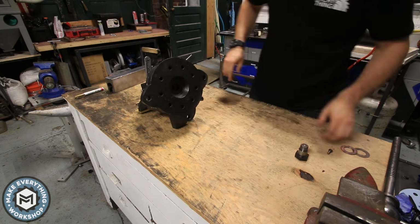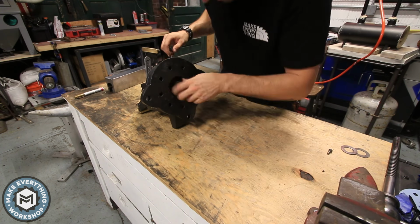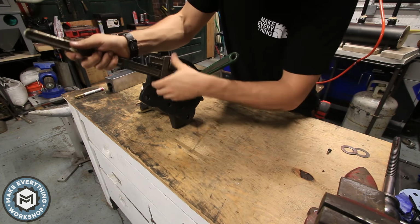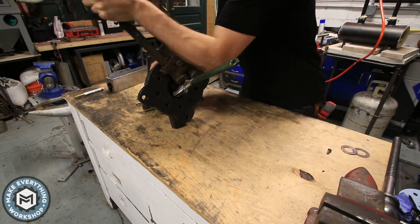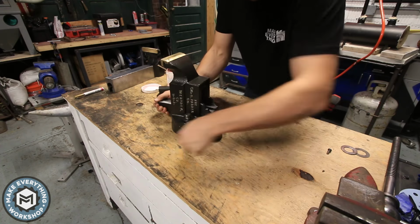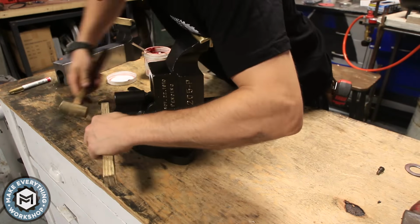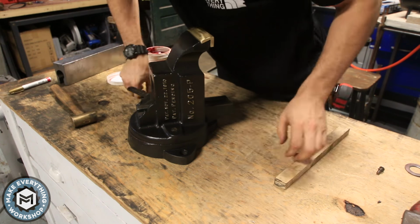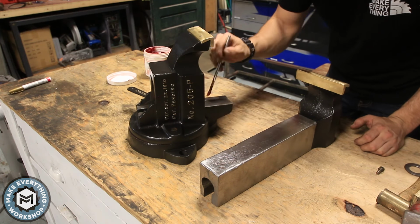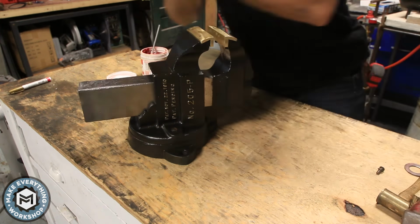And I decided to tighten down the swivel a little bit before adding that central nut that keeps the swivel base attached, using my ghetto 2-wrench method to get everything nice and tight. I'm knocking in the dovetail for the last time, and I get the little pin installed. I throw some grease inside those threads, and I can finally put the movable jaw back in.